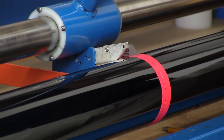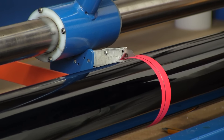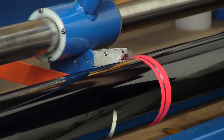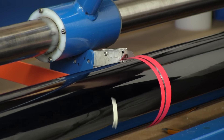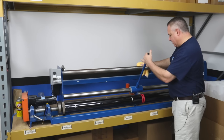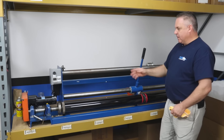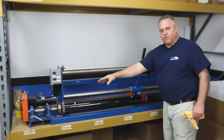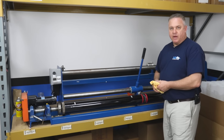I'm going to turn the speed up to about 60. The key is to just be gentle, don't force anything, and don't cause this blade to bend — if it bends, it frays the edges up. There's an art to getting really good cuts. We just lightly drop the blade down and it almost pulls itself through the film like butter with a sharp blade. Then it hits the core, and I just let the weight of it slowly cut through. Once it cuts through, it will stop spinning on the right side because that side of the roll becomes detached. I can separate this half of the roll, then cut the other half off. I'll turn the speed back down to zero, undo everything in the front, pull the swing arm out, take each roll off carefully one at a time, and then go to the packaging table to package the product. And that's how it cuts.